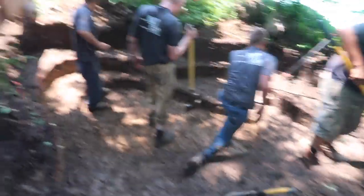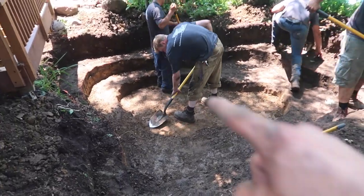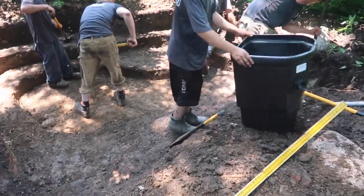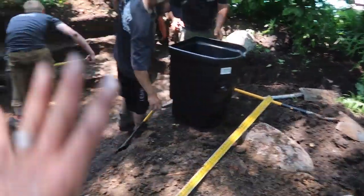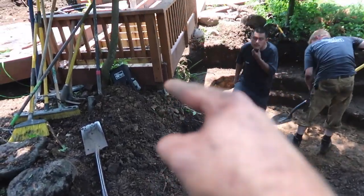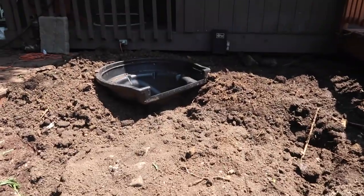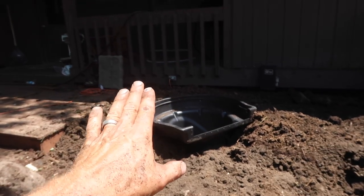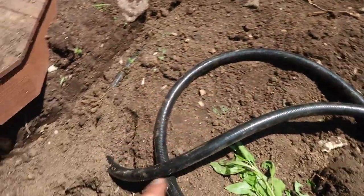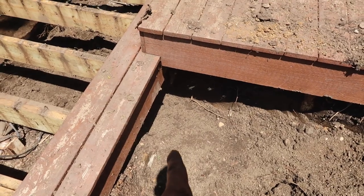All right, we're looking good. As you can see, everything came out — fabric, liner, all the old crap muck. We've got all of our shelves excavated. We're at about a two and a half foot depth down at that very deep section where Matt and Juan are standing. We are getting our skimmer, which is our mechanical filter, installed so that when we get the fabric and liner in the pond, you can go ahead and attach that thing right away. The pipe's going to attach to that bulkhead fitting right there, run this way outside the pond, go underneath that deck, and then run up that way and tie into our biofalls, which is our biological filter right up there. So you can see the biological filter is set. We rotated it and pushed it back another three feet. The existing one was somewhere right around in here.